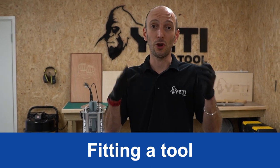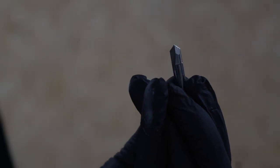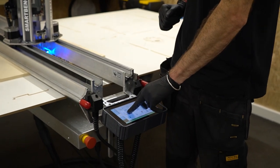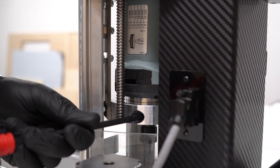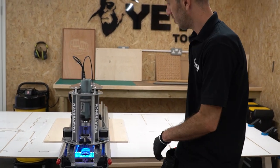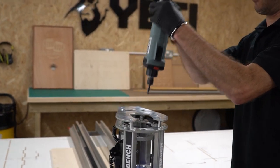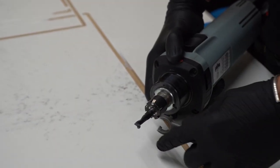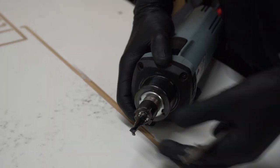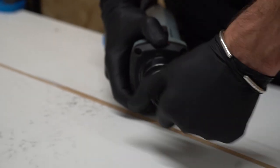Now work holding is done, it's time to put the cutter into the spindle. Our first operation is to engrave on the top surface, so we'll be using an engraving bit — the CAD file calls for a 90 degree V-groove bit. I'll move the Z head closer, take my driver to unclamp the spindle, disconnect the power cable and data cable, rotate the spindle and lift it out of the Z head. To take the tool out I'll push the spindle lock and rotate until it engages, take my collet spanner, undo the collet, slide the cutter out, and remove the existing collet so I can put in one that fits my new tool.